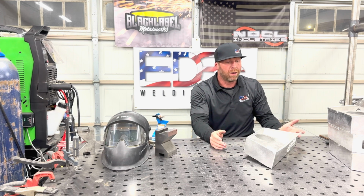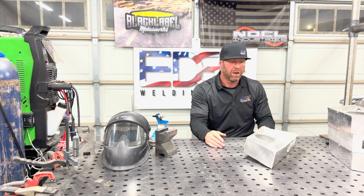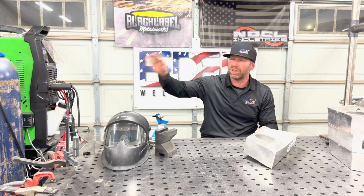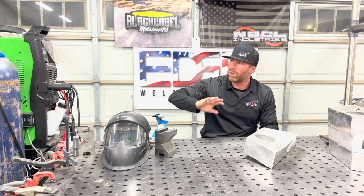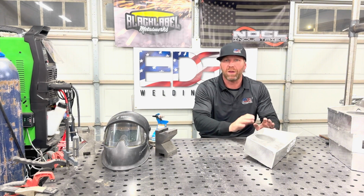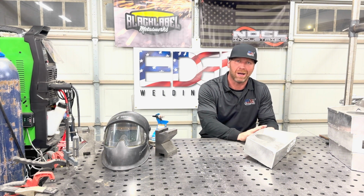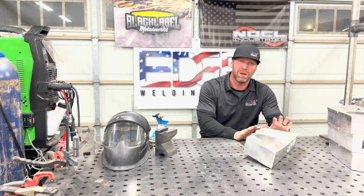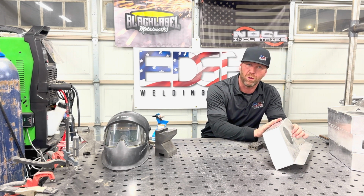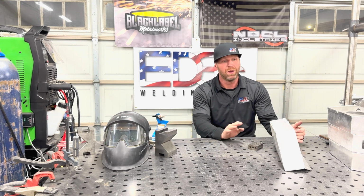So I have to balance my heat. Consistency and balance go hand in hand. I can give you my amperage, I can give you my CFH, I can give you all those things. That's relevant to me, not to you. So amperage, yes, it does involve heat, but heat in your part really is more time. I may weld faster than you. You have to have a certain amount of heat to melt a certain thickness of metal, but some of us use less and some of us use more. Some of us work the pedal and some of us don't.